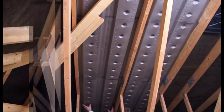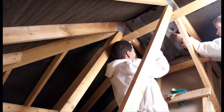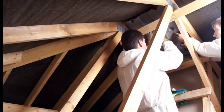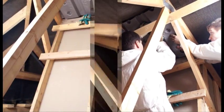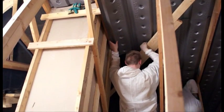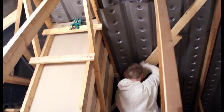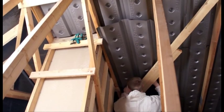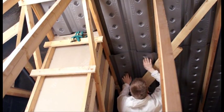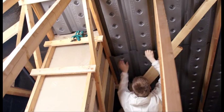This spacer system has two advantages. Firstly, it means that this roof will be fully ventilated and will never suffer from wet rot, dry rot, or any condensation build up. The second is that this spacer acts like a roof within a roof — so if the old roof felt ever leaks, water hitting the inside of the spacer will run out and down safely over the wall plate.